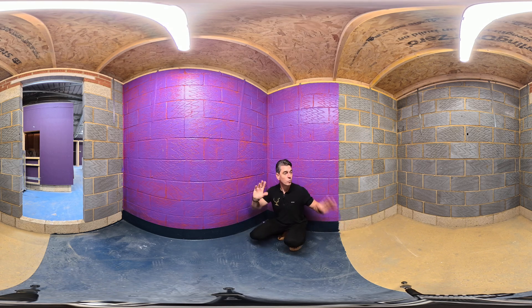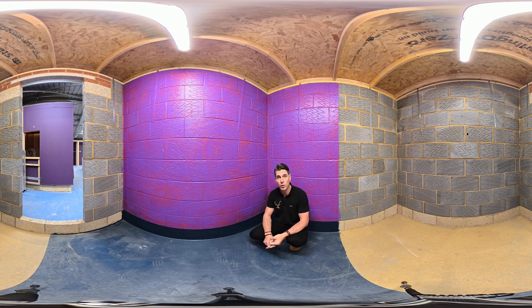Take a good look around. There are half of this building that's been treated with liquid applied membranes and half that hasn't. On the side that hasn't, you can see there's no DPM on the floor, on the walls there's no airtightness control, there's no vapour control, and all of these will lose energy through air loss and just seepage through the block work. Let's take a look at this side.